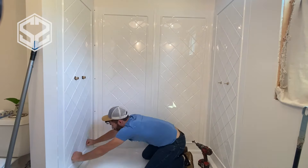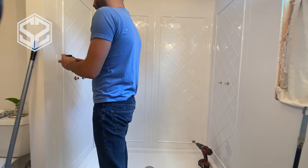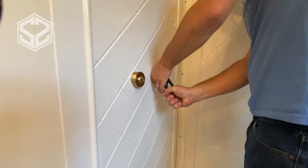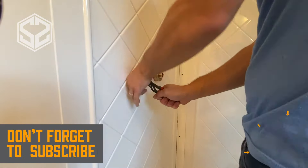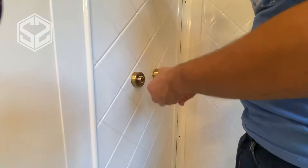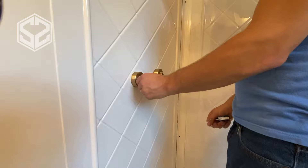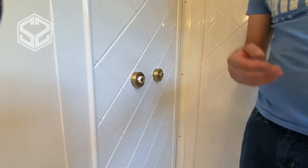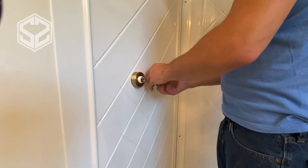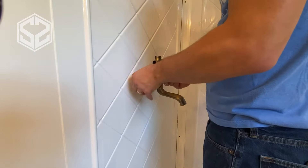Now I'm sticking the last panel to the wall and tightening down the corner molding — the kit is done. I'm going to continue finishing the valves and shower heads on either side, as well as putting up the moldings. I'm mounting the exterior valve and brass pipe on the wall for the shower head — it's all going to be on the outside, all brass, and it's really pretty. I'll leave a link in the description. While installing, I'm putting Teflon tape on every joint to make sure it's completely sealed with no leaks. Tighten it down as tight as you can get it.